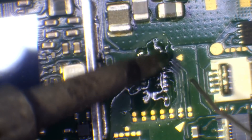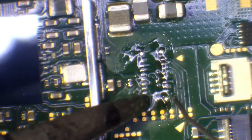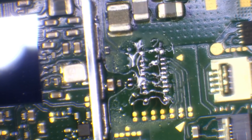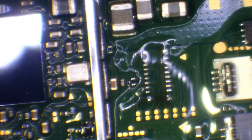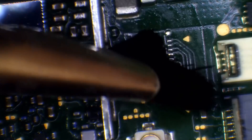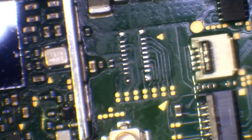I'll add some leaded solder — Kester 60/40. A few people have asked where I get it: I buy it from Amazon US, changing my region and using my UK address as delivery, takes about a week. I'll replace the solder with leaded solder, then clean up with isopropyl alcohol and a trimmed-down paint brush to make it more rigid — a trick my mate Vince showed me. That should give us sufficient solder on each pad.